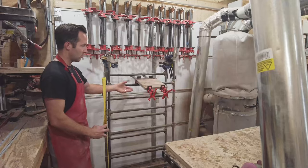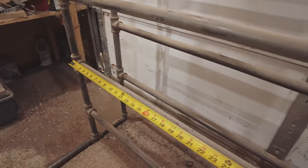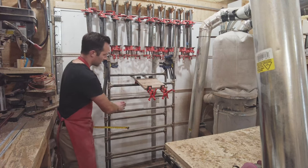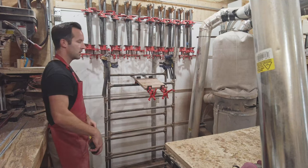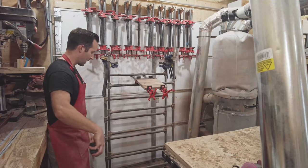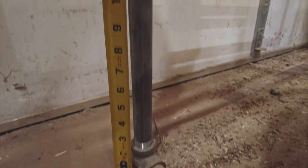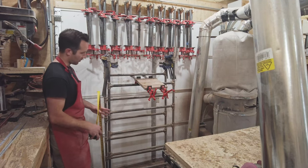If these were too close, you wouldn't be able to lift the rack and get it out of the clamp. The width is approximately 30 inches — you can do this any width, but I wouldn't go farther than about 4 feet, because then you'll start to get some bowing during larger glue-ups. The distance between front and back is approximately 9 inches. The feet are probably 20 inches long. The back row starts at 12 inches, and then you've got your pipes at the same distance from each other as the front row.